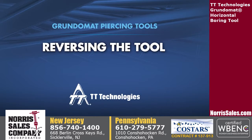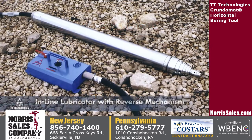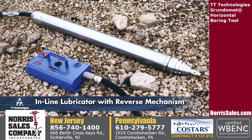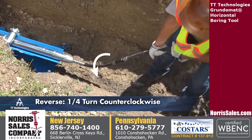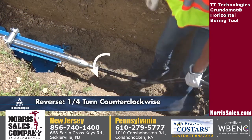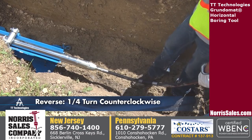The Grundomat can be easily reversed. 5 through 7 inch diameter Grundomats are equipped with a patented reverse mechanism that allows users to reverse the tool during the bore by adjusting a lever on the lubricator control system. Smaller diameter Grundomats are easily reversed by turning the air hose a quarter turn while in operation.